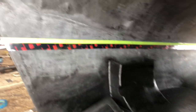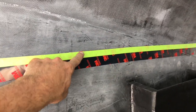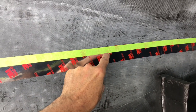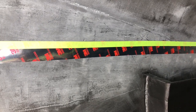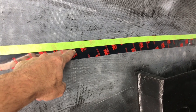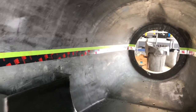Inside the cowling I've put green tape so I know where to slide the carbon fiber. The overlap goes here and I'll slide it up until it touches the green tape, then bag it in that position. This leaves an extra quarter inch that I can trim down and sand after taking it apart, giving me a full one-inch overlap for the screw joint.